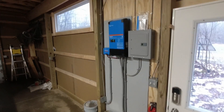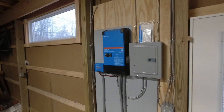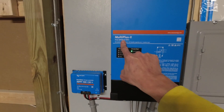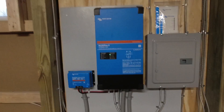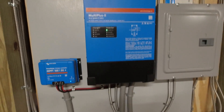My workshop's electrical system is built out of leftover parts laying around. It's basically a 12-volt system. I'm using Victron components and it says 12 volts, 3000 VA, which is 2800 watts. This inverter takes up to 17 volts even though it's a 12-volt inverter, and that's why I can use a Nissan Leaf battery.